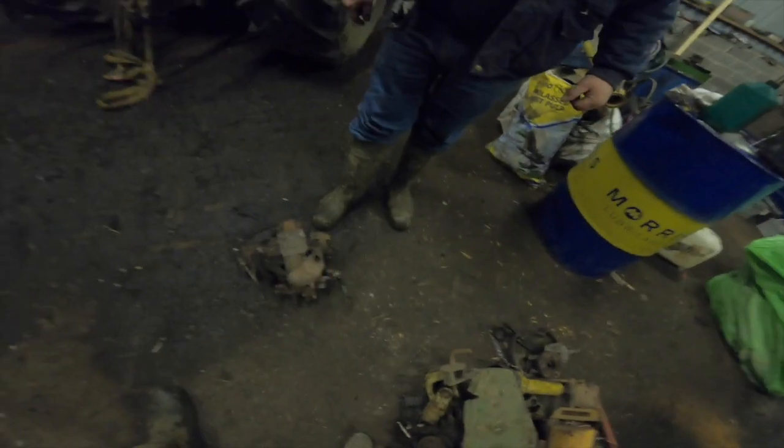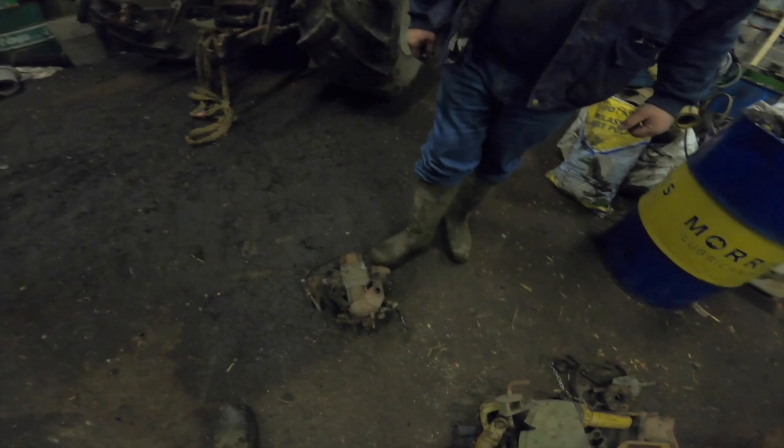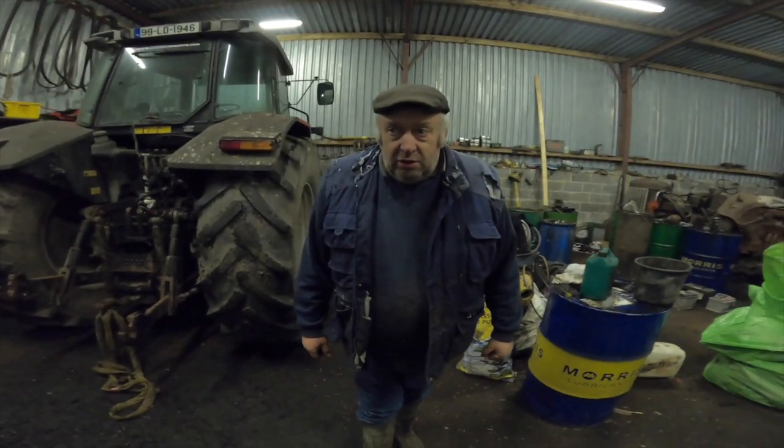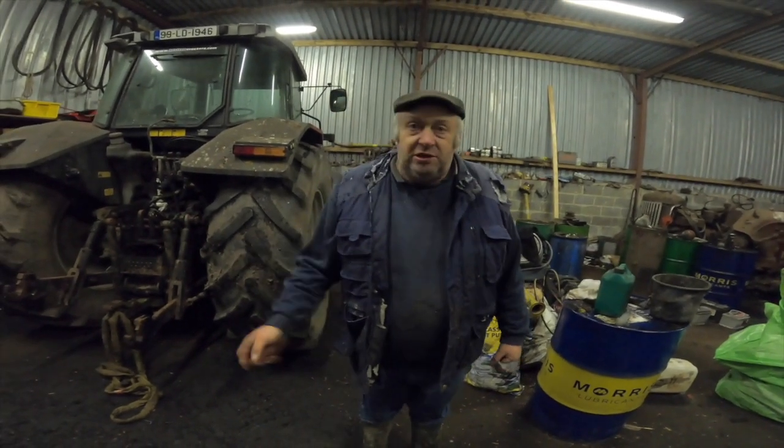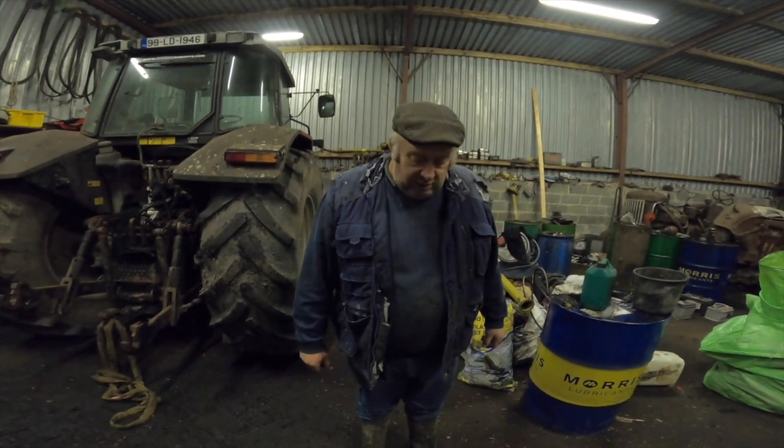Are they any good? Yes, they are. They're two good compressing units off a 6354 Perkins engine. Air compressors. They were all lorry engines fed into tractors. Yeah, the blocks of them. A lorry engine and a tractor engine are governed differently. You have to change the injector pumps. And in most cases, you have to change the sumps, and the way the oil was pumped around the block had to be completely changed. I put a turbocharged Dodge engine into a 2720 one time.